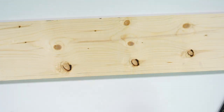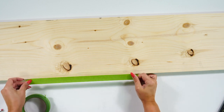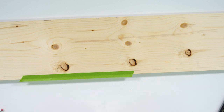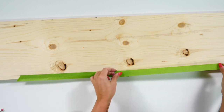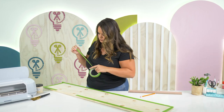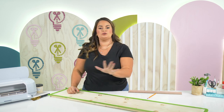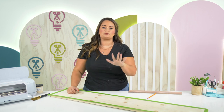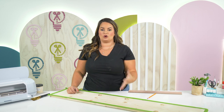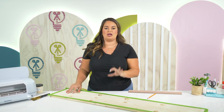Once you have made your marks all across your sign, you're going to take your painters tape and lay that along the edge of your marks, and just come in with your finger and make sure that it is down nice and smooth. Now that we've got that taped off, one thing I want to make sure you know — for best results you can give this a light sand. I have already given it a light sand before taping it off, but that is what the sanding block is for. With the chalk paint, if you are using a darker color, black mainly covers everything up, but because I'm using this white linen I did give this a light sand — so make sure that you do that before you start painting.